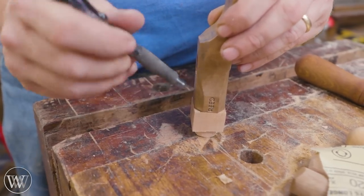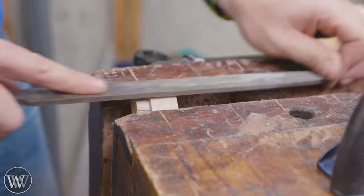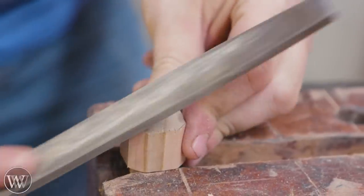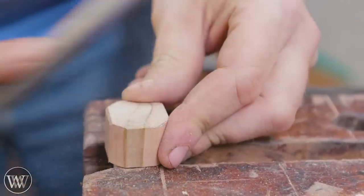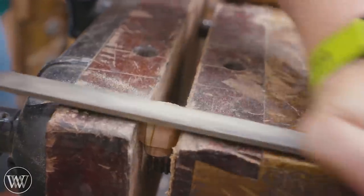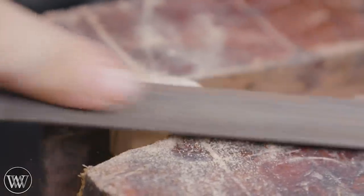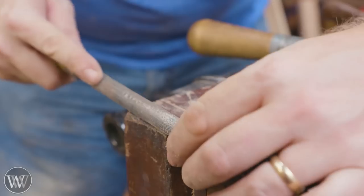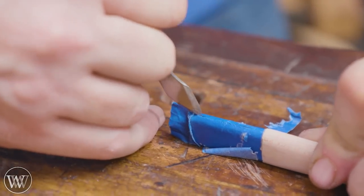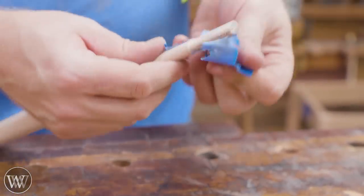At that point, we leave it alone - we don't drive it down on yet. Because if you drive it down now, what's going to happen is it will dry out in the future, the whole thing will shrink, and it will fall out. Yes, you can glue it in, but this is something that's intended to be consumable - you will be replacing this at some point. So it's easy to make it so you can pull it out, and not having glue in there makes that job easier in the future. We're going to make the octagons on the side to match the head, then file and smooth it down. If you put a small chamfer right on the edge, it allows it to fit in there so you don't see a tight seam between them - that little chamfer just looks a little sharper.